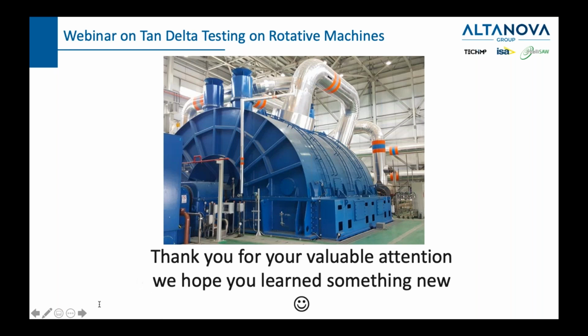Nunes Santos. Should we do the test changing the frequency on the test set of a motor generator? Motor and generator always, they don't work, they're offline. So motor and generator are at a standstill, they're not generating or rotating. What we do is we have to change the frequency on STS in order to get to the resonating frequency.